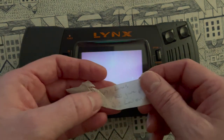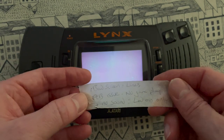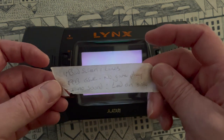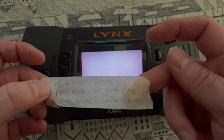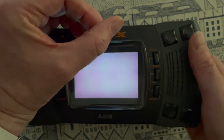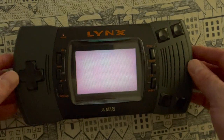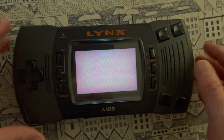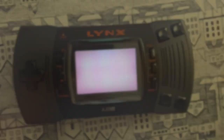Taking a look at the notes: bad screen lines, PCB issue, no gameplay, no sound, LED on only. Yes, you can see it — although it's very faint and the camera is picking this up better than I saw with my own eyes — the LED is there so it's getting power. It's very possible that just the backlight is working and not the actual processors themselves, so we're going to have to have a look at that.